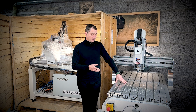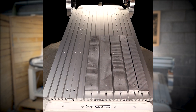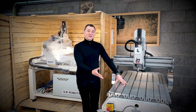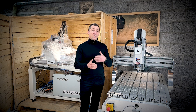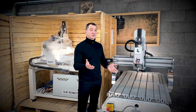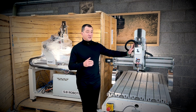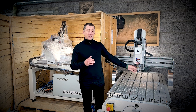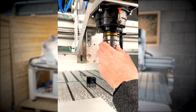I'll tape my stock to the table or bolt it down to the fingers of my spoilboard, machine away, and after an hour I come back and all my components have been profile cut, ready to take off or chamfer for the next operation. If you watch one of my very first videos about the machine two years ago, that's when I installed these fingers — and I'm still using the same ones, now about three years old. The productivity far outweighs the initial cost of the aluminium stock. I'd like to talk about the spindle — this is really a torque monster.